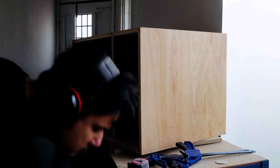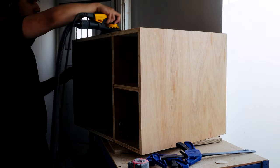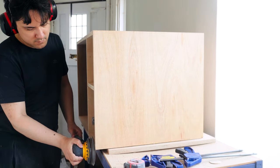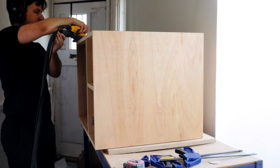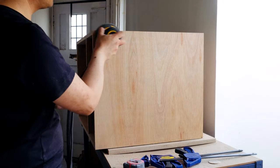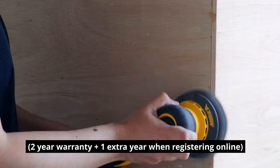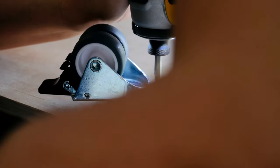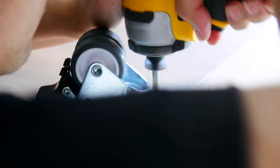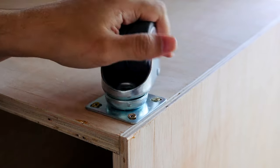This highlights the big difference between second hand vs new — the warranty. When I looked for the Festool model, I could firstly only find it affordable second hand, and even then it was still more expensive than the Mirka brand new. I know that may vary country to country, but for me it was clear to go with a new Mirka, which includes a 3-year warranty vs none at all. So why would I recommend upgrading your sander first? Well, it may come at a big cost at first, but the time saved from sanding is significant and such a massive benefit, making it worthwhile on balance over the life of the tool.